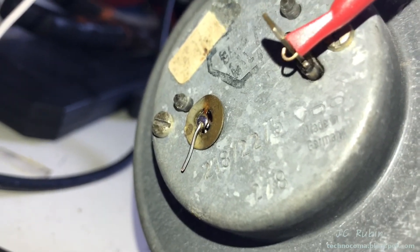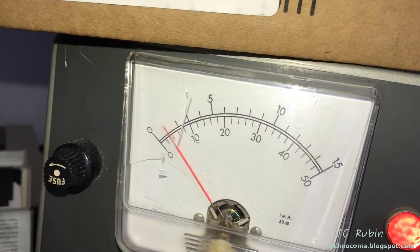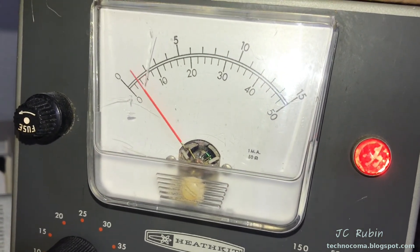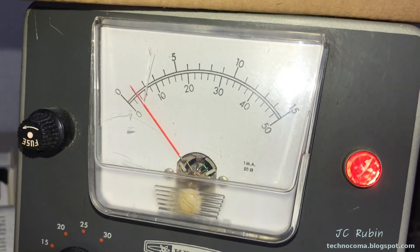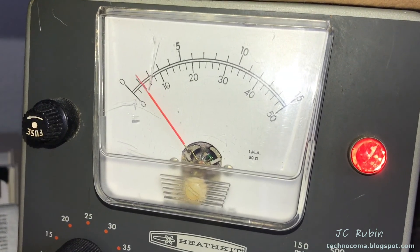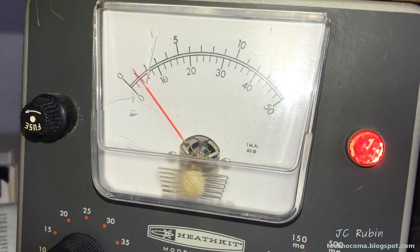This could be clipped off after it's soldered. The clock is working nicely back in the shell where it's protected. I want to look at the current for a moment. This is the pulse every second — there's the current jumping up. The resting current is measured from a different location than before — this is 0 to 50 milliamps. We can see that resting is just over 2 milliamps and then it pulses up to 6 milliamps to drive the clock.